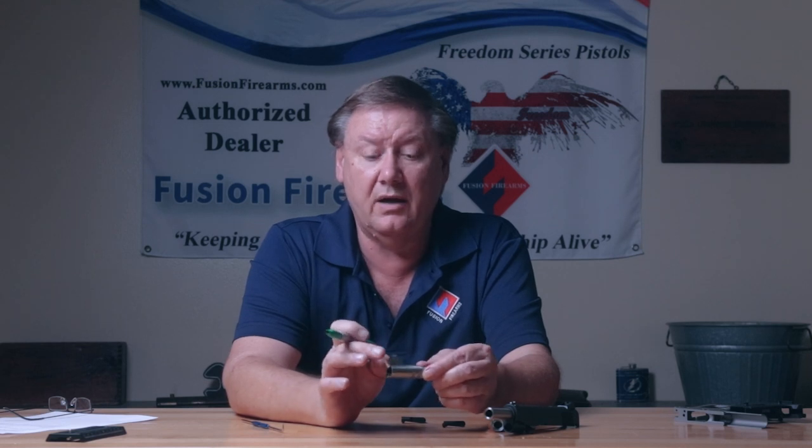You may have to fit the barrel foot area. Also in consideration is your link — what link size do you want? I generally prefer setting up with one of our Fusion match barrels with a number three link and starting there. Depending on how worn or how tight the pistol is, you may want to adjust the link. But I generally like to stick right around the number three link. Once in a while you'll go for a number four, but generally a number three is really the way to go for most people's standard fitting.